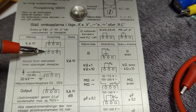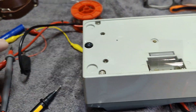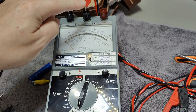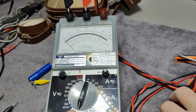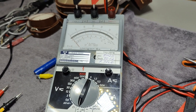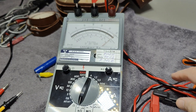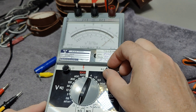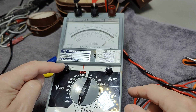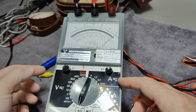The high voltage range — you need to use the two most outer connections. Okay, let's try again. I think I did figure it out. I'm using the correct banana plugs — kilohms times one — and then if I zero it, see, now it works. You adjust to zero, and that can be done real carefully like that. This switch here is the overload protection switch.